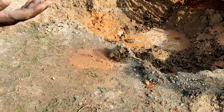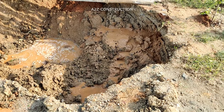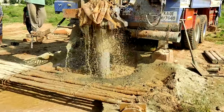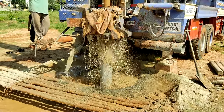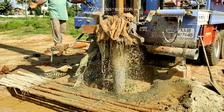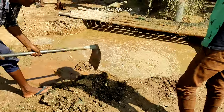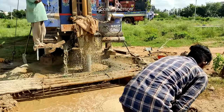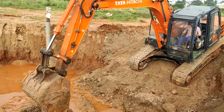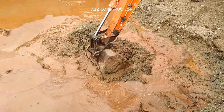You can observe that as we are drilling for the borewell, water is popping up from the ground level itself. You can just imagine the amount of water table in this site. Since the water table was very high, obviously at a very lower depth, we got a good amount of water from the borewell. And since the groundwater content is already high, we are making a path for the borewell water to drain from this space. Here we are excavating the complete site since we cannot go for isolated footings due to the bad condition of the soil.